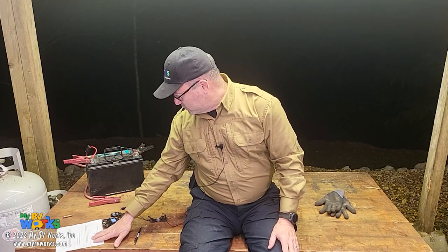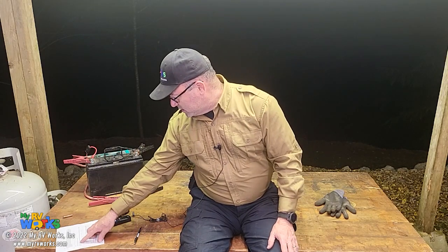So we're going to take your meter, and when your refrigerator now you're going to go to the back of your refrigerator, you're going to take the cover off. The main access cover with the two little knobby screws, you're going to pull that thing off, and then you're going to see your control board there. Usually it's on the left-hand side, but sometimes they're on the right, depending on what kind of refrigerator you have. You didn't tell me what kind, except Dometic. Okay, you've got a Royale. So yeah, you've got the older style refrigerator.